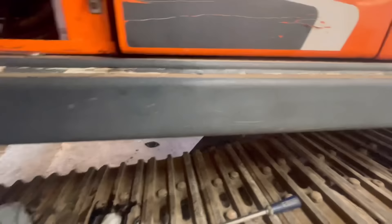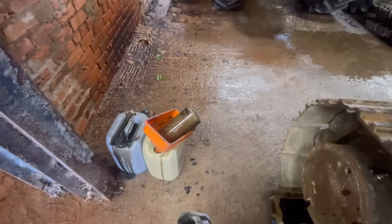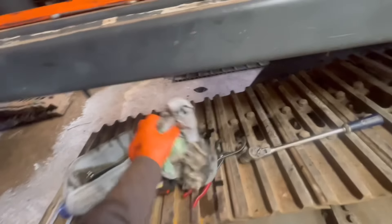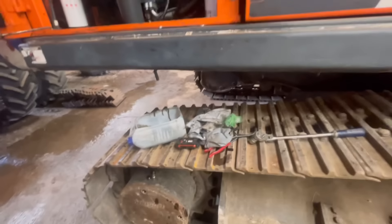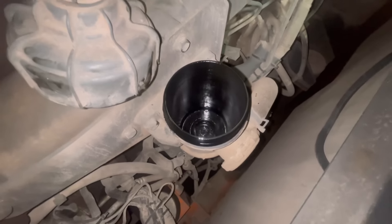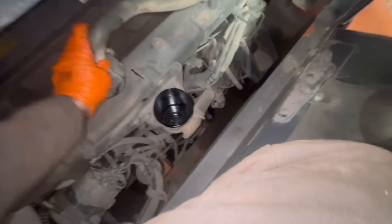We might do it itself — we'll see. I've run out of waste oil storage. That one is full to the brim and that one's just about the same. I've still got the slew gearbox to drain yet, so I'll chuck my engine oil into it and I'll have two empties. I'm just going to change the breather filter — I've literally just taken this off. No breather filter in there. Why would you do that to yourself? I'm going to put one in because I've got one.